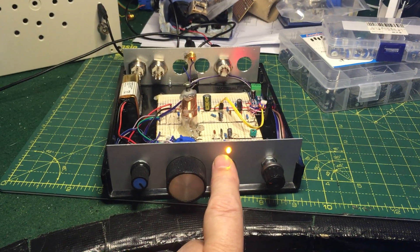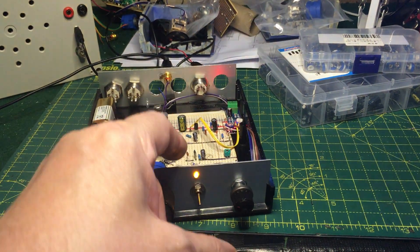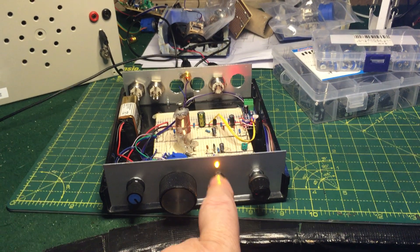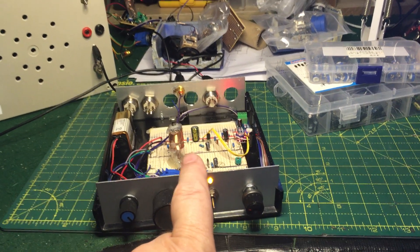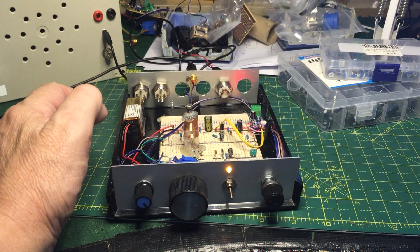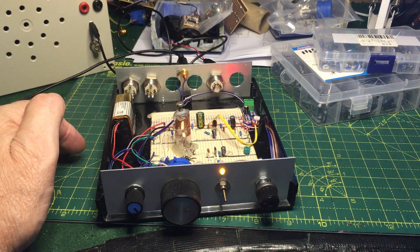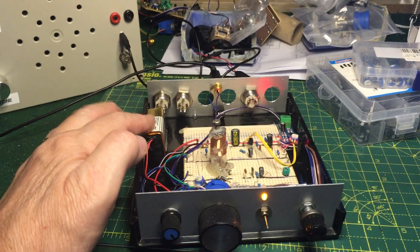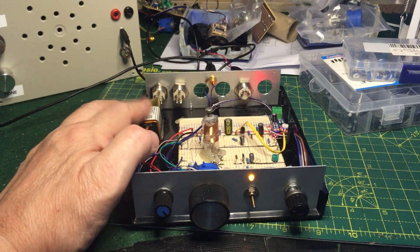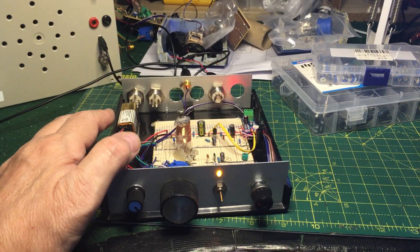I just stuck a little LED on there just to show when it's on, so I don't leave it on. And I've got quite a high resistance feed to that LED, so it hardly uses any current really. I don't want to drain a lot of current just lighting up an LED. The radio doesn't hardly use any at all. The little preamp uses about 15-20 milliamps. I've worked it out - on a PP3 you should get about 20-odd hours of continuous use, so it's not bad really for an alkaline PP3 battery.